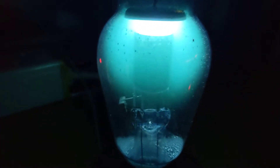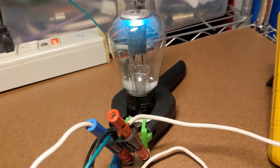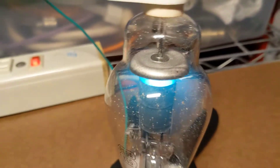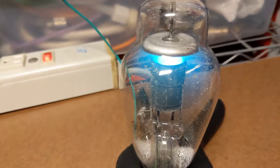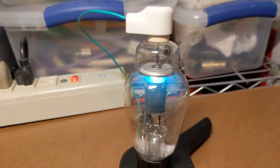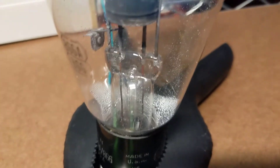That's just a mercury vapor plasma in there. If you're going to work with these tubes, obviously you don't want to break them because there's mercury inside. Also make sure the filament voltage is activated for a good amount of time — at least 15 minutes, if not 30 or 40 minutes — before you turn on the B-plus on the plate, because the mercury could get jammed up between the filament and the shield. If you turn on high voltage then, you might cause a short circuit. Always let the tubes get hot and evaporate the mercury. You also have to always operate these tubes with the base pointing down — don't run them on their sides or upside down, because the mercury likes to settle, and the best place for it to settle is at the bottom of the tube.